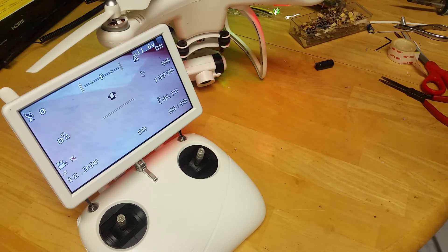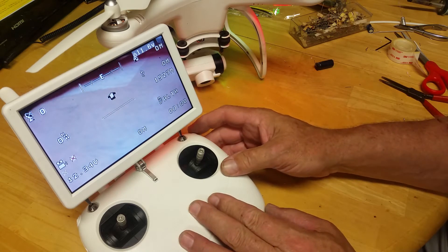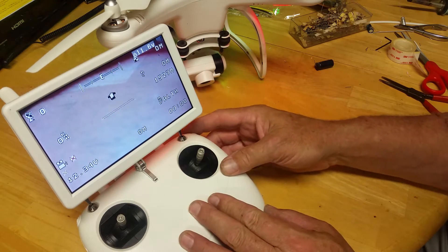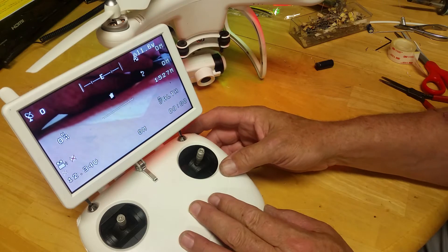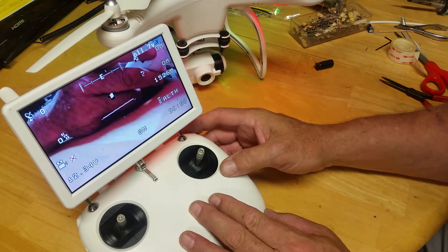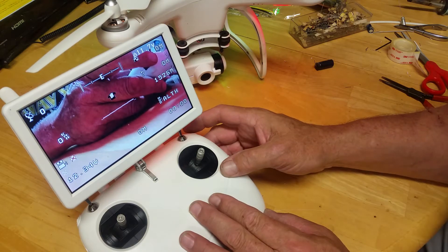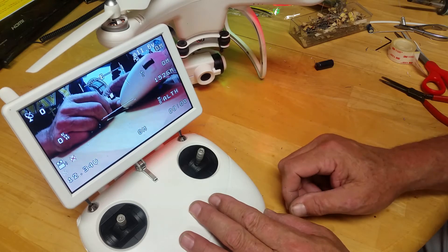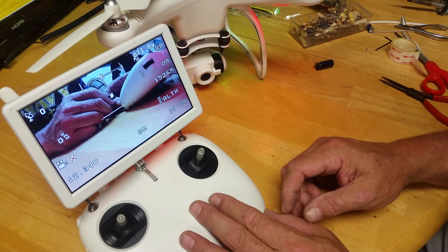Here are the results of my camera pitch angle modifications. I bring the pitch up to a normal level to show what we're seeing. This adds a 2200 microfarad capacitor and a 700 ohm resistor, which was really my first guess as to what might be effective here. It was adequate so I went with that. The schematic is on the page.